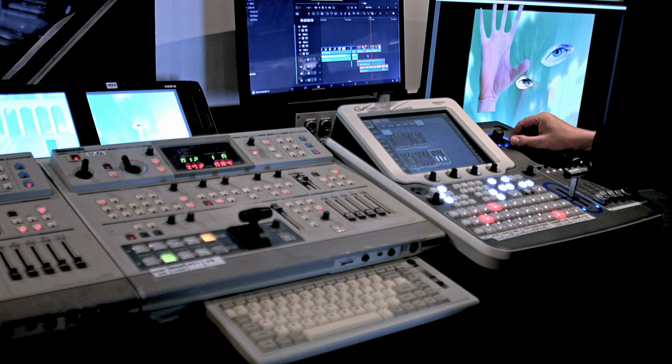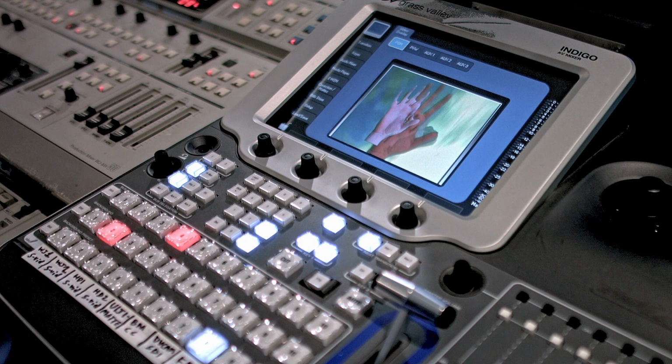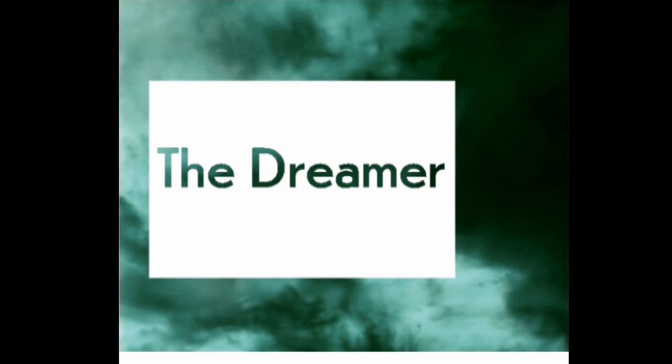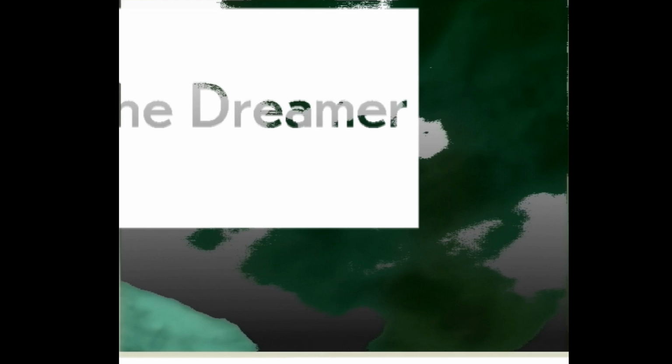One very important feature of most vintage video gear like this is something called keying. This is where you overlay just one section of a video onto another. You need two sources, and then you can choose how to select parts of the top layer to superimpose on the background layer. There are two methods, Luma key or Chroma key. Luma uses brightness to choose. So, for example, only the bright bits get superimposed, which is good for overlaying text and simple shapes.